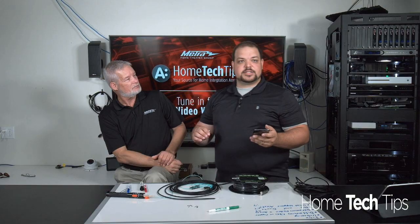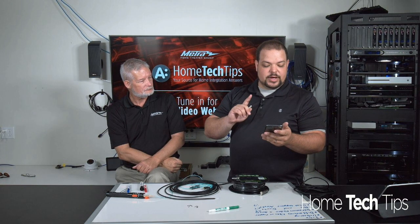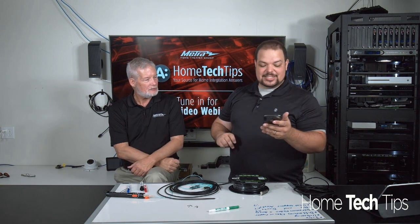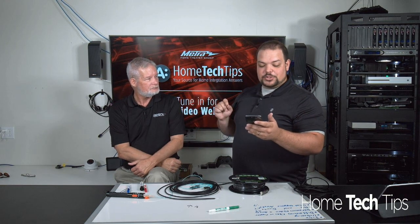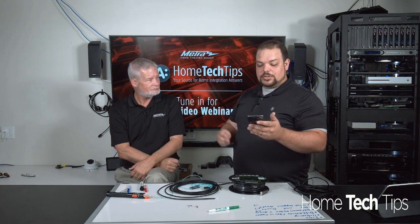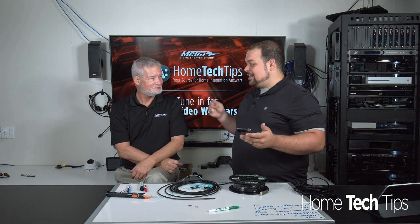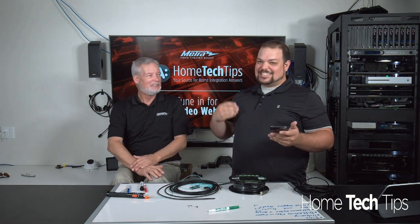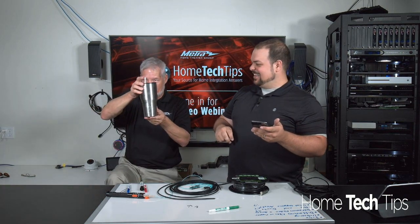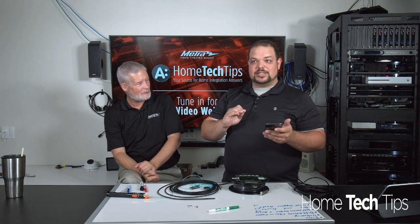So real quick, guys, thank you for letting me borrow this. We have one more question, but also Alex, you just posted on there, and I really like this. Alex says, as a tip for running conduit, we drill holes at the low point drainage to let the water out. Winters are cold and freezes the water, and it's true. That's what causes the splits. We do forget down here in sunny Florida that ice is a thing that doesn't go in our drinks. Yeah, exactly. So, Alex, you're exactly right. That's a really great tip.